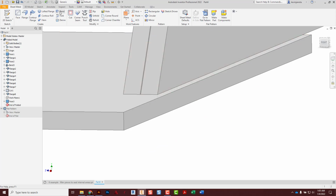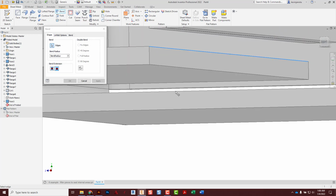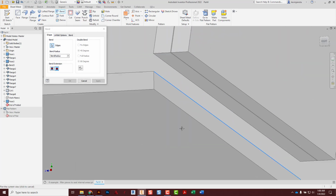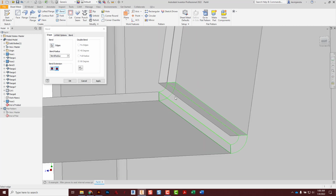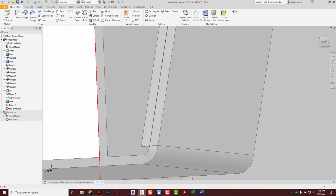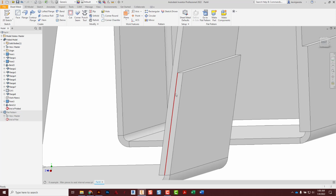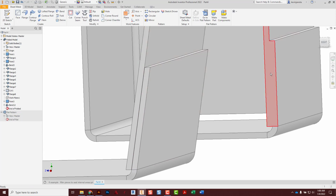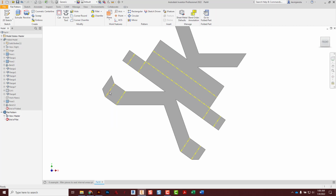And I'm going to go to the bend tool and click here. And I hope this really works. Just got to rotate it around so I can see that other corner because things are so tiny here. And there we go. And sure enough, it's previewing. I click OK. I mean, in reality, this actually looks more realistic because you can see there's a gap there versus this other lower one where that surface is all joined. And to truly see if it works, let's go to flat pattern, and there we go. Look at that, we got the parallelogram happening up there for that flange. Looks good.